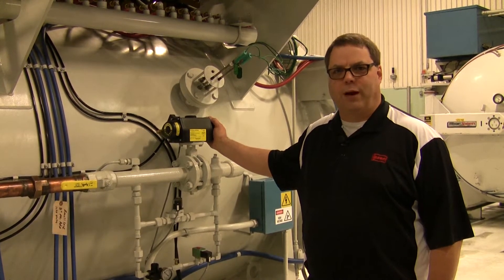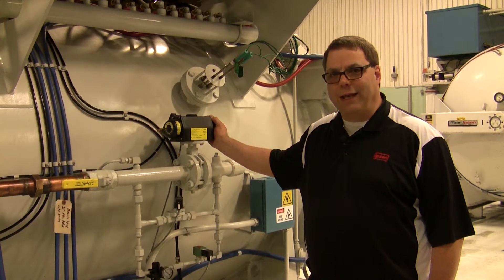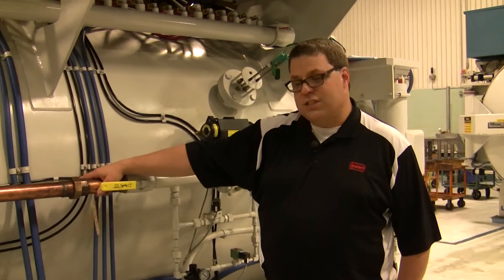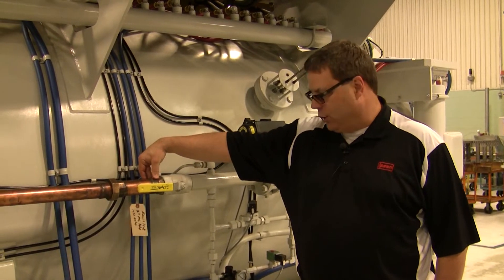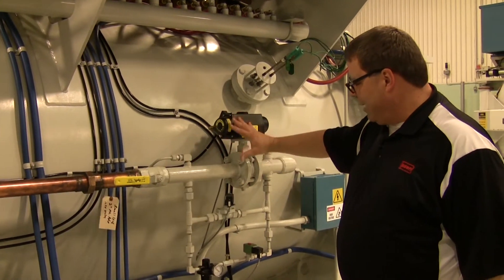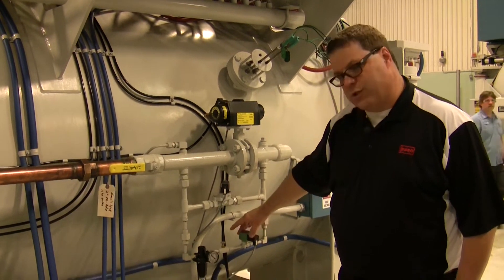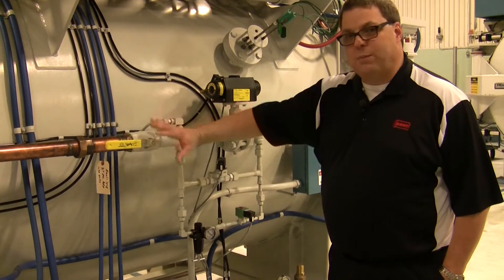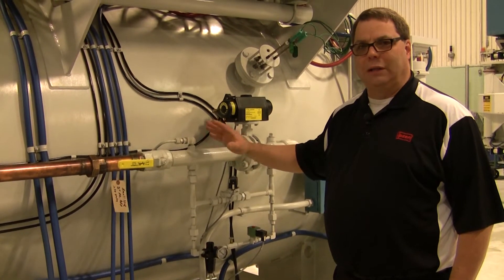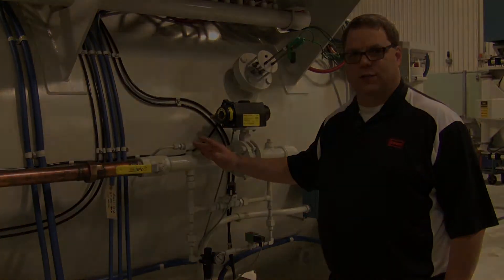We're going to discuss some of the correct procedures for maintaining and charging the gas assembly. The furnace is fed with inert gas normally from one point connection, one focal point. The argon or nitrogen enters the furnace through the backfilling and through the partial pressure subassembly. This must be maintained at the highest level of purity — zero leaks are tolerable on this delivery system.